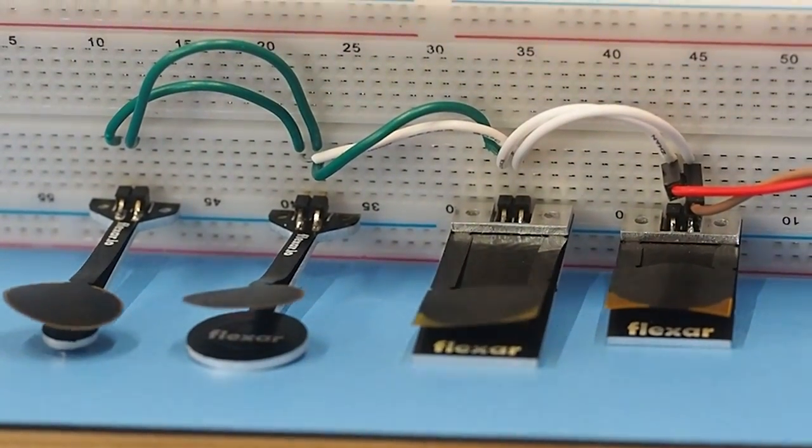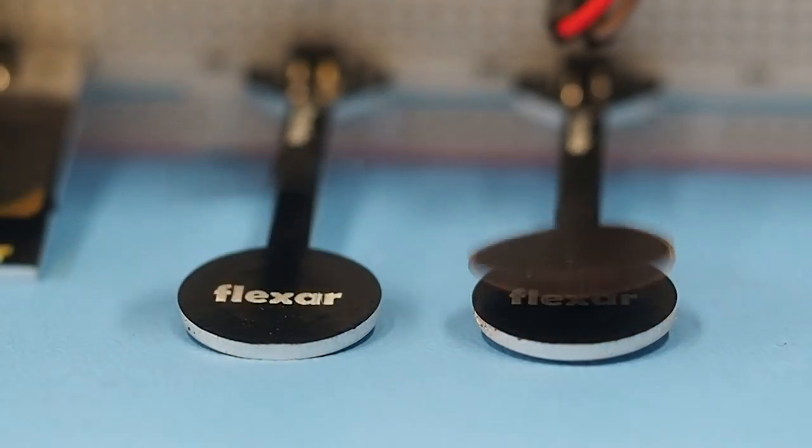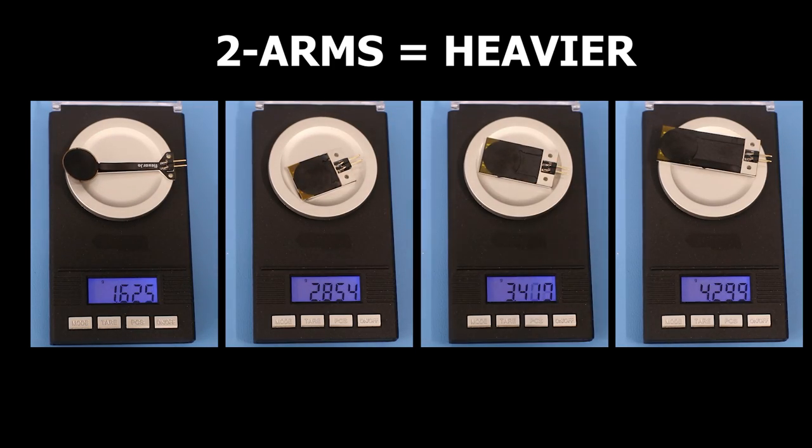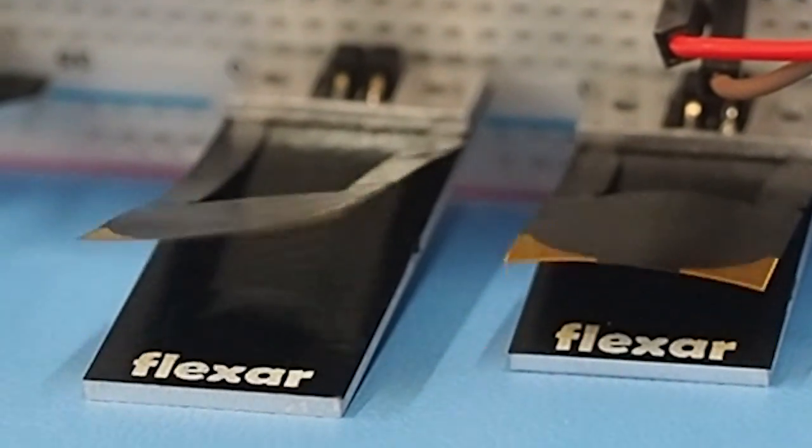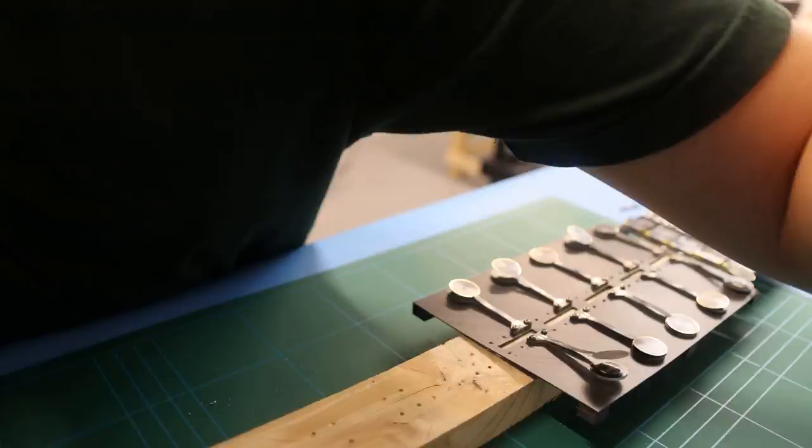The new PCB also included two-arm samples. These have all the same features just mentioned, but should also make the flapping more stable, because the one-coil arms are supported from just one point, which I think can degrade the coil faster due to unwanted vibrations on the roll axis. The two-arm samples are obviously more chunky by comparison. One small issue I noticed is that at very low speeds the longer arm was doing a little twist on the coil — I think it has to do with the shape of the coil's magnetic field. The 35 mm length sample was not doing this, so I decided to stick with it.